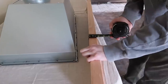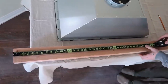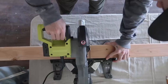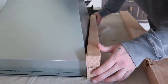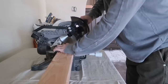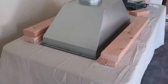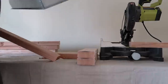For the framework of our vent hood cover, I'm using some two-by-four boards from the hardware store. I'm measuring the width of our vent hood insert and adding three inches — that accounts for the pieces on the sides to create a full box. This is going to be the front horizontal piece. I'm tracing it onto the board and cutting out four of these for the top and bottom framework, plus four more pieces for the left and right sides.